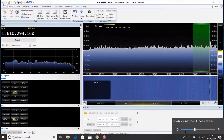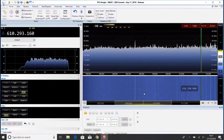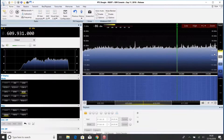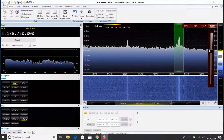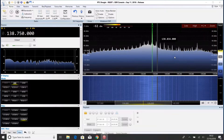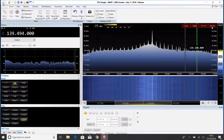Maybe let's get the volume down a little bit. So we are receiving now and we are hearing a whole bunch of noise. Different types of modulation — we've got AM, FM, Narrow, Wide FM, BFM — not sure what BFM is. Whenever you've got a different shade or color on the waterfall, that means there is something on that frequency. Let's try to find something exciting. Here is some signal and it is somewhat strong, but again this antenna is not what it's supposed to be. Here is the main signal and all the harmonics around it.